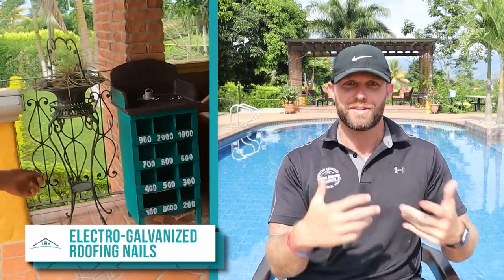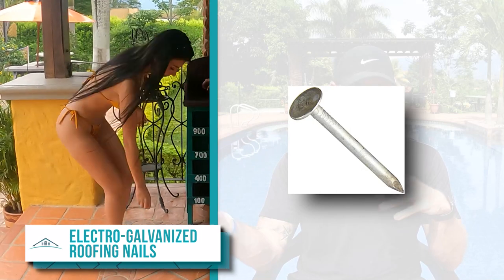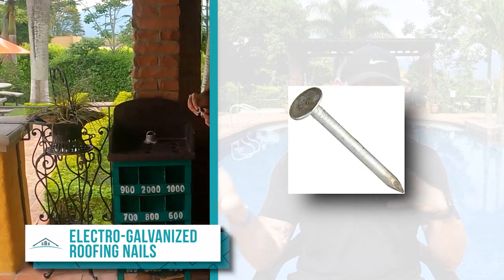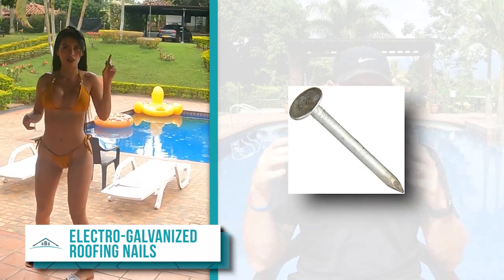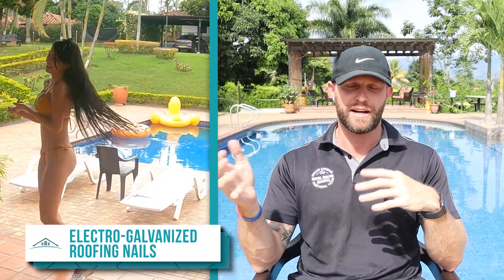Now, you also have electro-galvanized nails. These roofing nails receive their zinc coating through an electrical current solution, which attaches zinc ions to the base metal. Both work really well. Some people like the electro-galvanized more than the hot dip galvanized, but again, with an asphalt shingle roof, as long as you buy a high quality galvanized roofing nail, you are good to go.